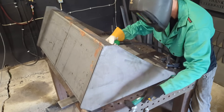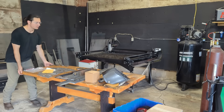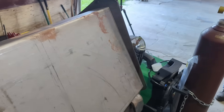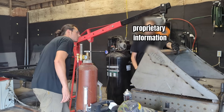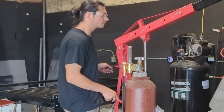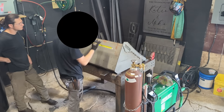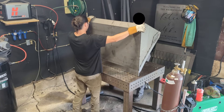We're only doing the bottom because the back of the bucket was not formed within the tolerance of the angles that we needed. So we actually had to bring in this cherry picker to basically pull everything up until it matched the angle. We were supposed to be within about a half inch from the back and we were probably sitting closer to an inch, inch and a half. So we definitely needed to bring that back somehow. This process went fairly smooth until we had it just about where we needed it — and I decided to give it one extra little push. Needless to say, we're definitely going to have to figure out a different method next time. It was a two-man job — one guy holds it at approximately a half inch, then the other guy tacks it until we had both sides done.